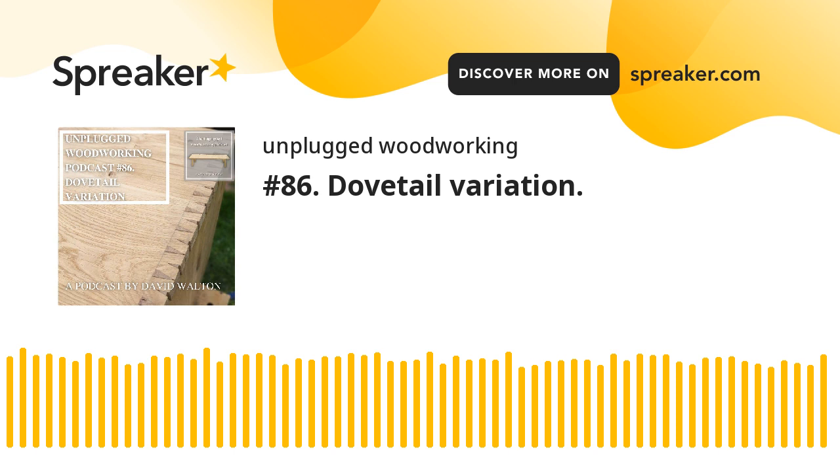The one I've just been cutting today — visually, that's probably one of my favourite ones. The only issue I have, which I mentioned at the start of the podcast, is that the middle section of the pin — which is technically a finger joint inside of the pin — that's too thick. The proportion of the joints just isn't right. But for the sake of practicing and the fact that it's for myself, I've done it as a practice but I'm also getting something out of it — I get to use it as a drawer.